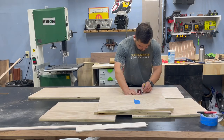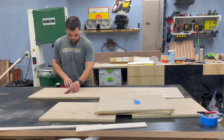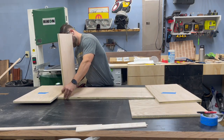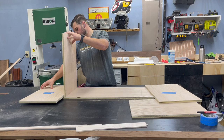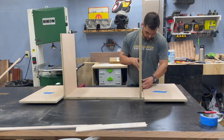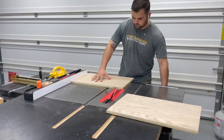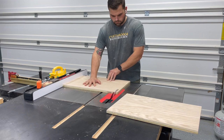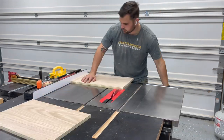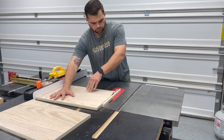With all my parts cut out, it's time to start figuring out where everything's going to land and start cutting some joinery. I divided this sheet up into four sections — one quarter on each end and then a half in the middle to give good spacing for that farmhouse style, because we're going to do some sliding doors later on. Just getting everything roughly placed and taking measurements. For the middle dividers, since they're sitting on top of the plywood and not on the edge like the outside ones, I have to cut three-quarters of an inch off to get them to sit flush and be all the same height.